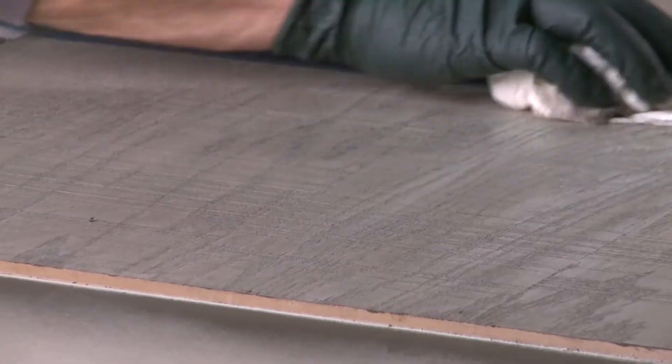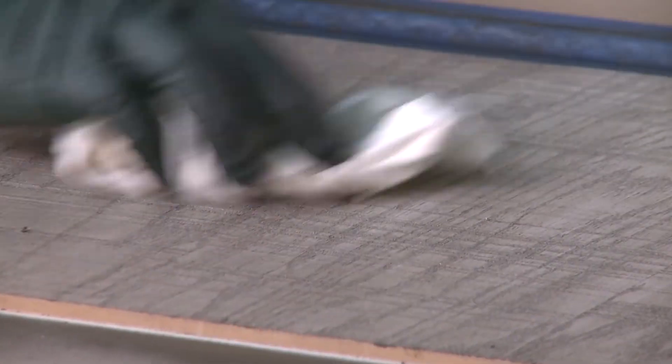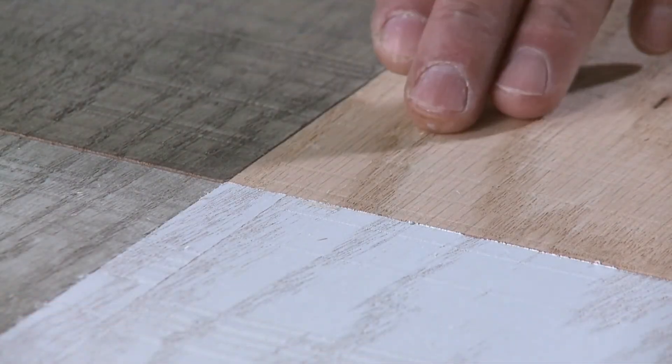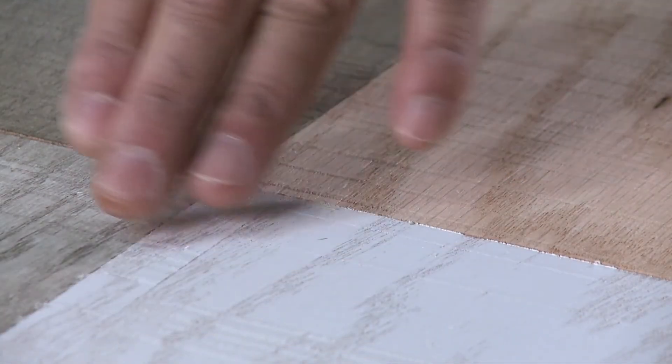By the way, you can be pretty creative with these Touchwood panels. In this case I v-grooved along the seam lines, stained each plank in various ways — kind of a tongue and groove look. I encourage you to explore different techniques. With the Touchwood panels, hey, the sky's the limit.